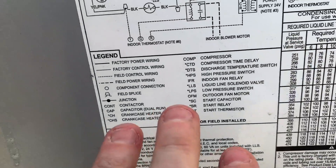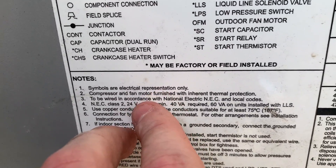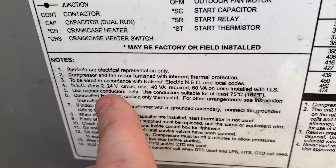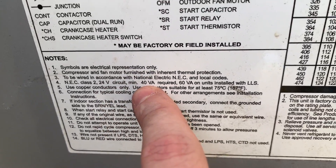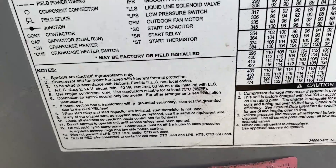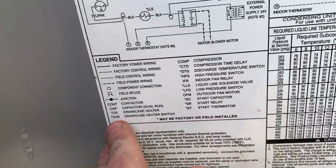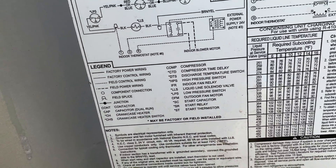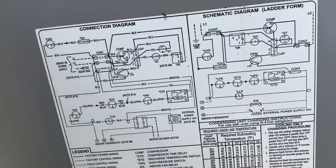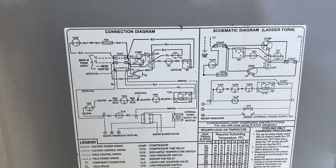So that's how you apply this. When you start with these diagrams, it's good to look at the notes section. Symbols are electrical representation only; the motors have inherent thermal protection meaning there are thermal overloads. It also tells you what size VA transformer is required. There's lots of really good information here, and you'll find it makes a lot more sense — especially if you're new — to go through and understand everything on the diagram. Pay attention for things that may not be present; they may just be shown because they could be installed. That's a basic connection and schematic diagram walkthrough on a Carrier straight cool. Thanks for watching.